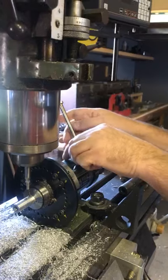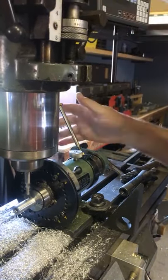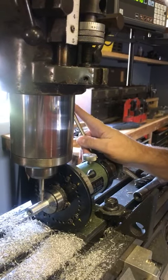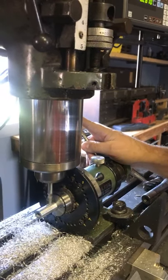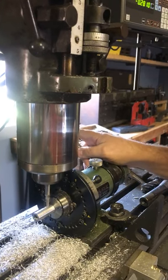With my end mill up I'm going to pull my pin out of my location, back off my set screw, loosen my quill, plunge down — and then with my right hand you'll see I'm pushing that lever away from it slightly as I continuously plunge the slide-over slot.